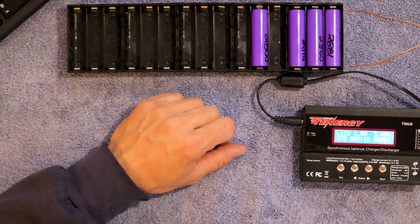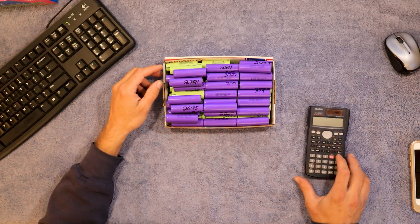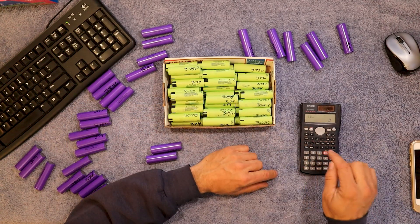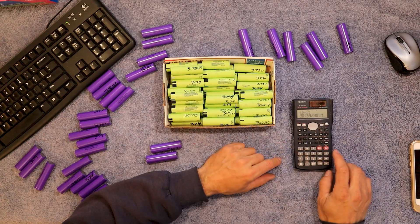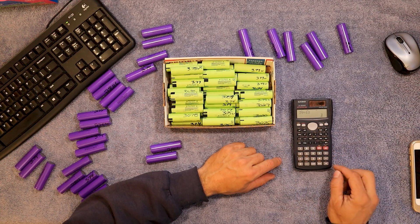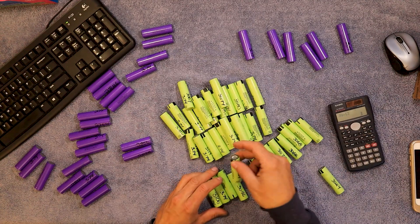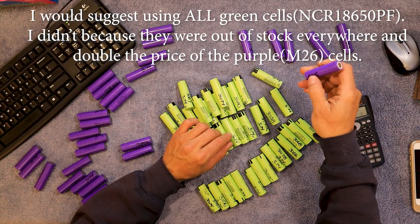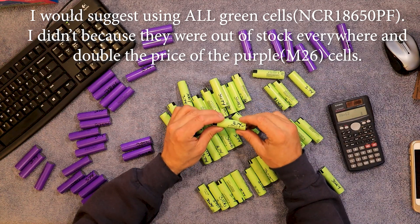Now I'm going to show you the cell builder and start punching some of these in — start selecting my cells. These are the available cells that I have. The original battery had 40 cells in it. I'm turning this battery into a 48 volt battery. If I take 40 and divide it by 13, that doesn't give me an even number. But if I take 39 and divide it by 13, that gives me an even 3 per row, so that's why I only need 39 of them. These cells were really close — I was very impressed with how they tested out. They test out a little bit better than these, but these are good too — just a little closer.